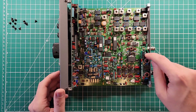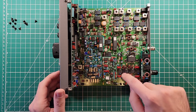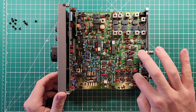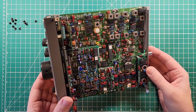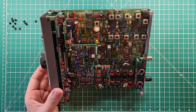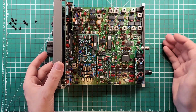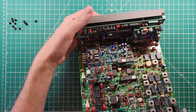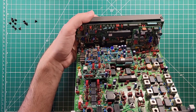You can see that there are a bunch of relays — these little black boxes that say Omron are relays, and they are surrounded by a bandpass filter, which would enable us to switch bands. So you can hear the relay click, which means you've switched into this band. The board doesn't show what the bands are, though it is well-labeled for what the components are. This radio was manufactured in 2002, making it 21 years old — it is now legal drinking age, since I'm recording this in 2023.